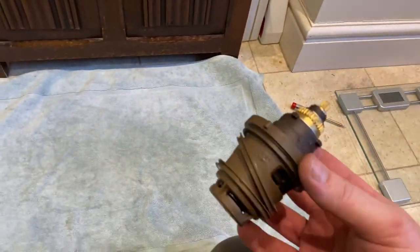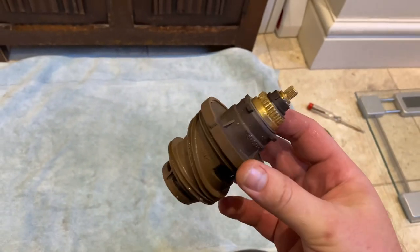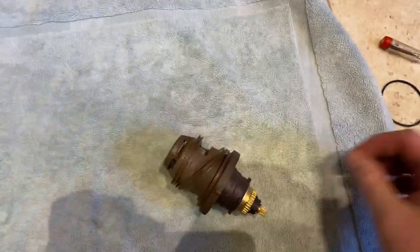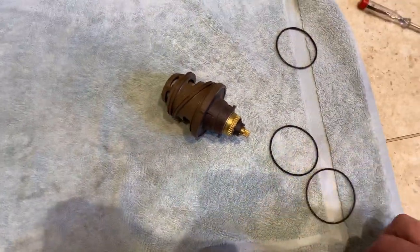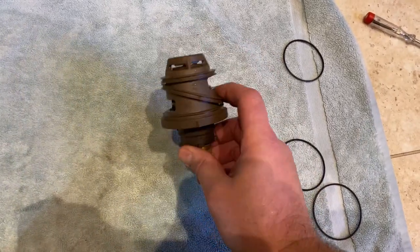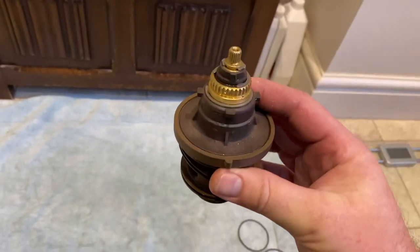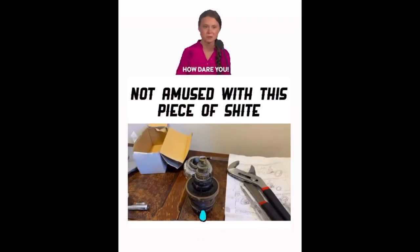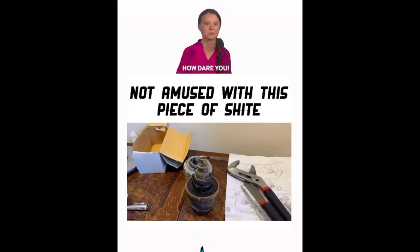So I've had a bit of a nightmare with this. It turns out the new cartridge that was supplied doesn't let hot water out no matter how much you alter it — basically the new cartridge is faulty. So what I've done is took the old cartridge, took the old O-rings off, put the new O-rings onto the old cartridge, because we know the old cartridge worked. Refitted it and all's sorted. It just turns out the new one that the client had bought wasn't working. Typical Friday afternoon ball ache job — go to do a shower, they supplied the valve, take it all out, put the new one in, hot's not working, take it all back out, put the old one back in — and that one's now leaking. The client's now ordered a new valve to be fitted when it arrives. Really pisses you off.